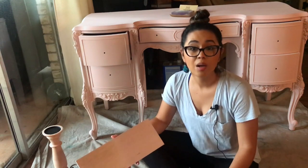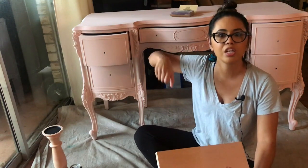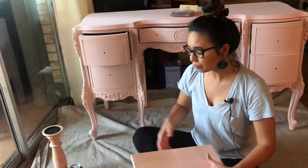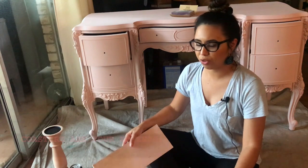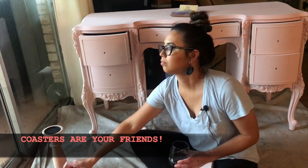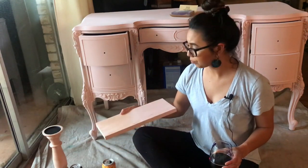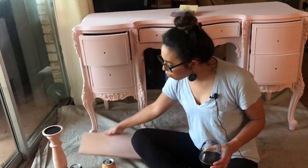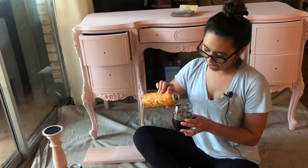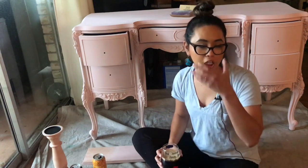I'm so torn. Part of me wants to do the polyacrylic because I know the countertops will probably get cups with makeup brushes. And if I'm using this myself, I'll probably be putting makeup on and having a beer while I'm doing that, although I'll probably put a coaster on it, so it'll be fine. I just don't know. I can wax and age over polyacrylic, as you can see in this part, but it has a different finish. It's shiny. It's not high shine, but I don't want it to be shiny because I'm going for a vintage, aged, worn look.